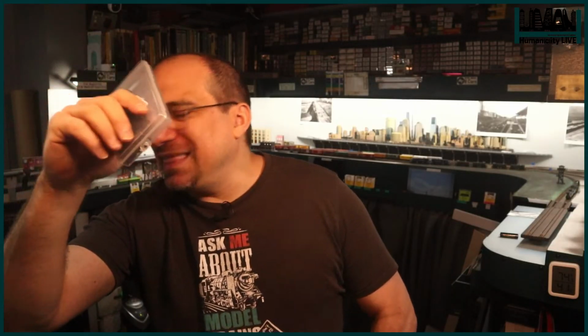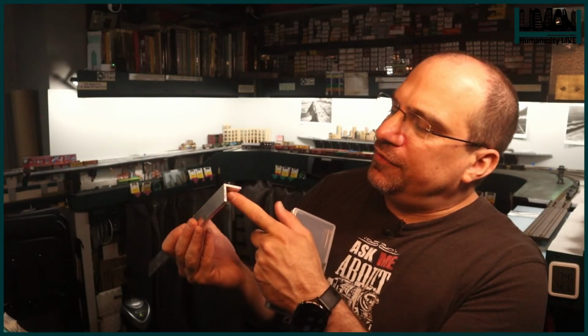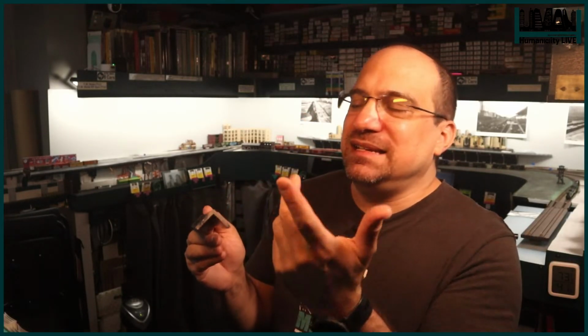I bought flathead screws, and I thought what I was gonna just do was countersink the holes. But then I really started thinking about it, and I started saying, you know, 1/8" material, if I countersink the holes, it doesn't give me a lot of meat left. So I decided I wasn't going to countersink the holes, but now that means what I've got is a rail with the edge of a screw head basically sticking out.